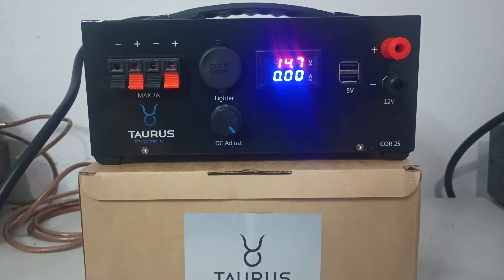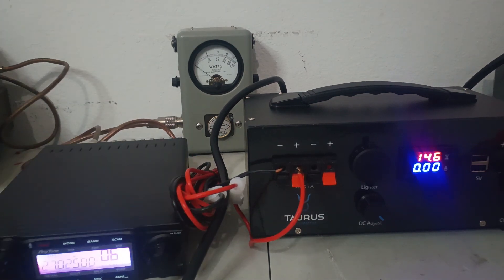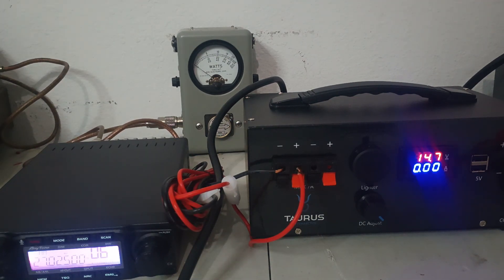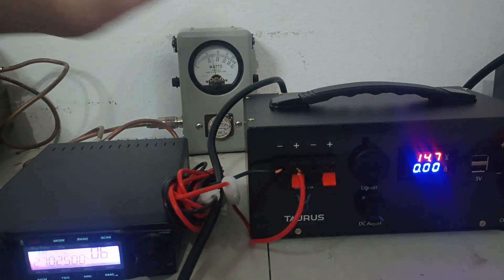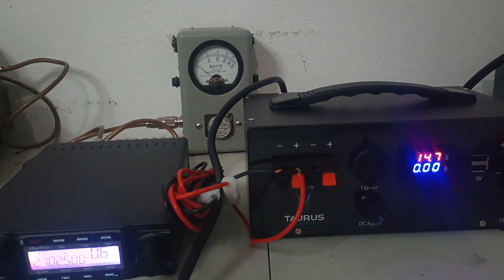Alright, we're back. I've got a converted Anytone Quad 6 Pro over here — it has not had any mods or upgrades done to it. Hopefully we'll get a video done on one of those pretty soon to show what they do, but it's a stock radio. We've just got it hooked up to the little terminals over here and it's reading 14.7 to 14.6 volts. We'll put our meter on peak in the back — 100 watt scale, 100 watt slug — so we'll be looking at the bottom to see what we've got.